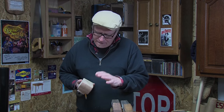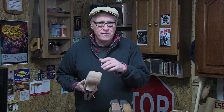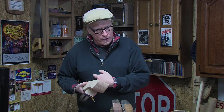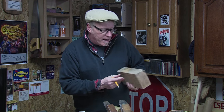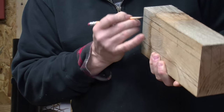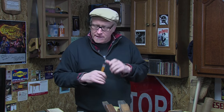One of the things you have to watch when making your own hand plane — this is simply a piece of red oak, you can make them out of anything — is the grain direction. Just like when you're sanding or hand planing a piece of wood and going against the grain gives resistance, you want the grain on the sole of the plane running in the right direction. Look on the side of your block — the grain should be running downhill. I use the analogy of petting a cat: head to tail is smooth, but reverse it and the hair stands up. It's exactly the same thing.